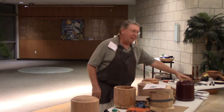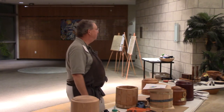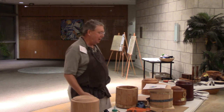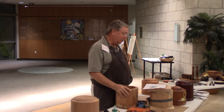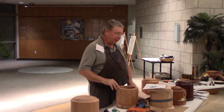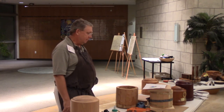The newer urns are not as tall — normally they're about a standard size; I made that one large at a customer's request. It takes about eight hours to make one from start to finish and consumes about three and a half to four feet of lumber. For 100 urns, that's 350 to 370 board feet, about a gallon of glue, two quarts of shellac, a pint of oil, 400 screws for the bottoms, about two sheets of quarter-inch plywood, and 800 hours of labor — a pretty big commitment by everyone involved.